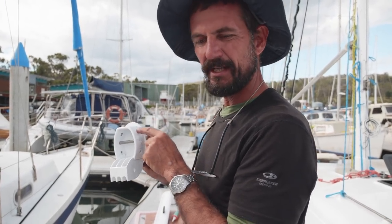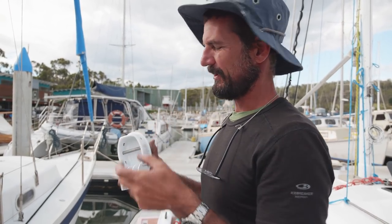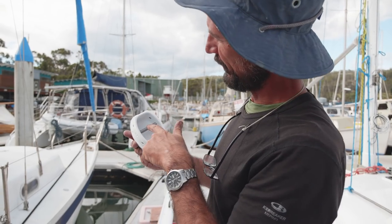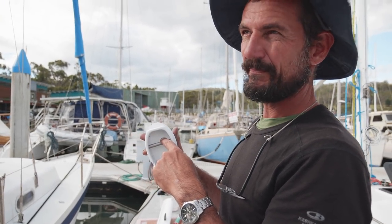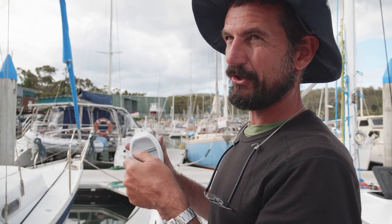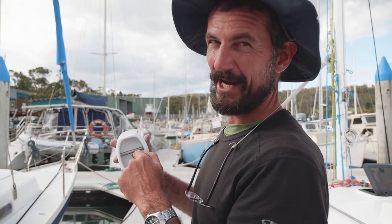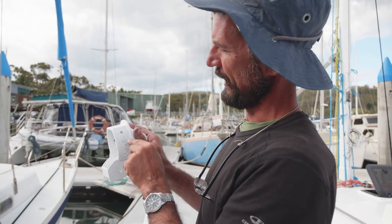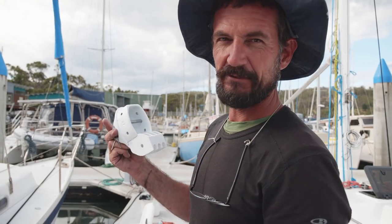And at the other end, instead of big rivets and a pin, I've also threaded that. But what I've added is this. So I went and got a 5/16 bolt that wasn't being used anymore, cut the head off and cut the threaded section off. So we've got this smooth 5/16, about 8 mil rod. And I drilled and countersunk some holes here and I've put it in. I've just filled it up with fix-it.